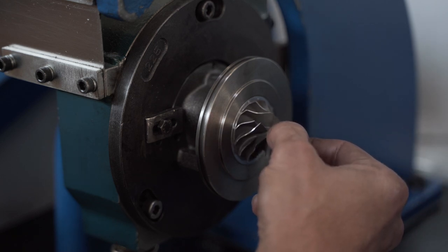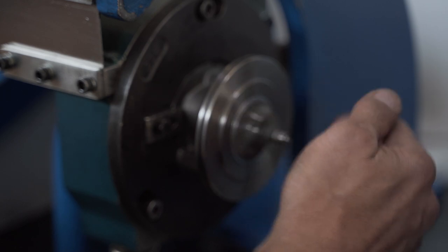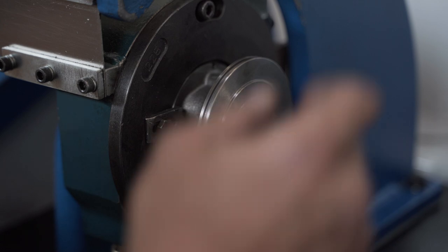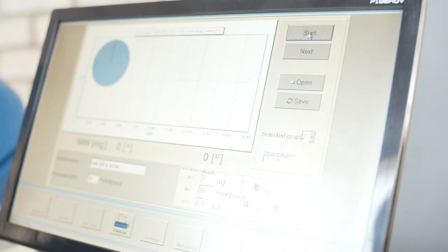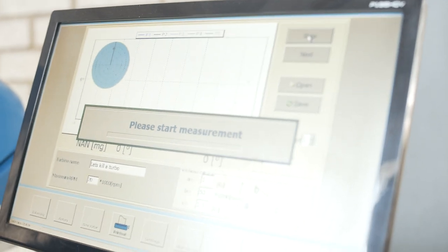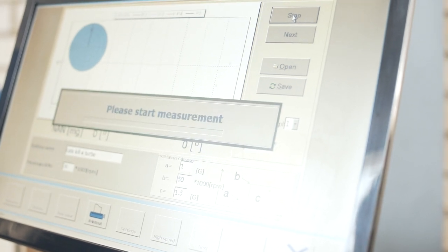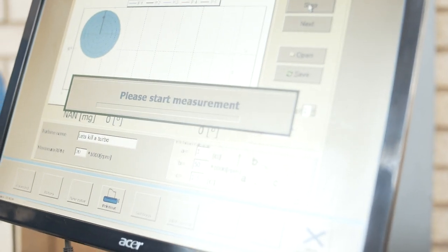This is more than likely as close as damn it to the side of the actual radius profile of the turbine, of the compressor housing, because there's been bearing wear. Let's run it one or two more times at half a second, or 0.4 of a second, and then we'll go upstairs, disassemble this, inspect the surfaces under the microscope, and we can go from there. Okay, here we go, guys. Right, it's 0.43 of a second. One more time.